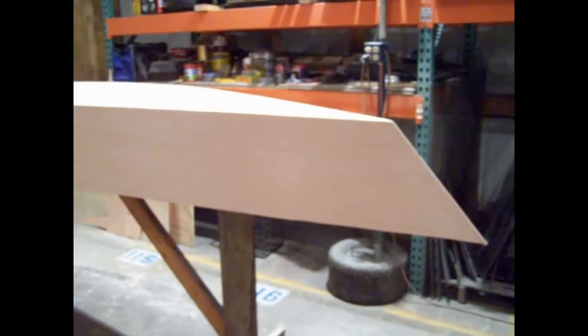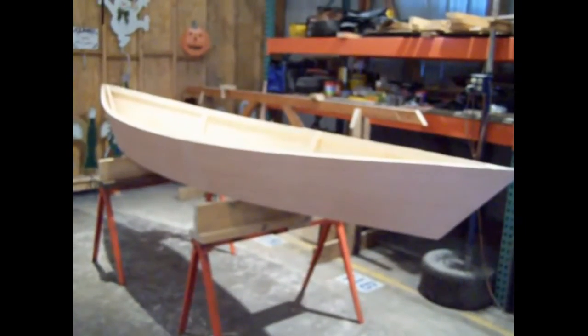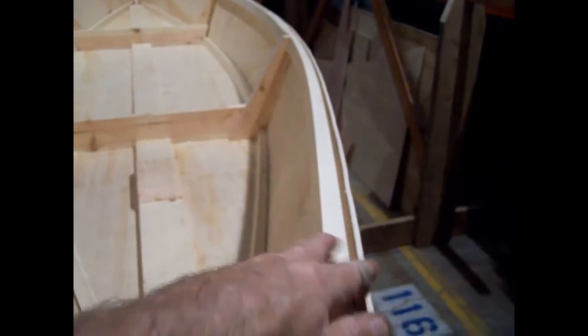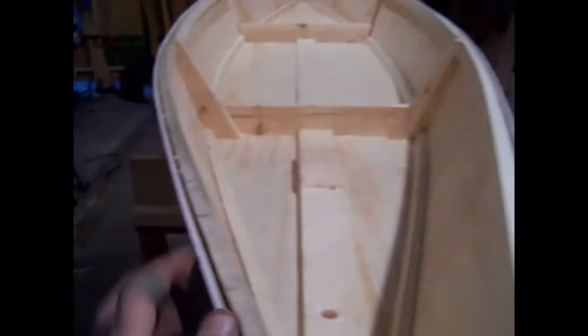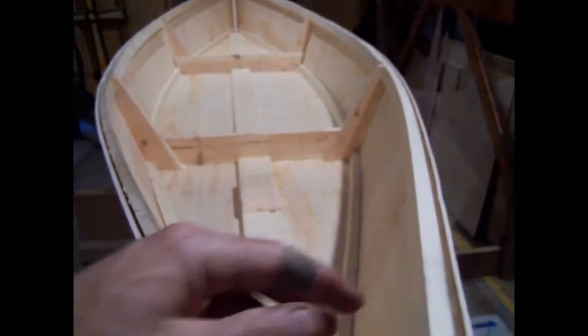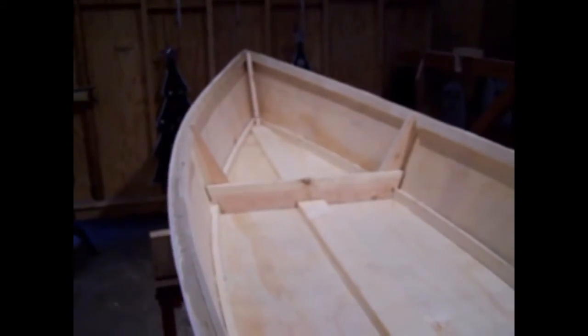I got all the side panels on, the bottoms on, fronts are glued to the stems. I trimmed all the excess off the bottom with the plane and got all the corners sanded nice. So now we're going to flip it over and see what it looks like. Just got it off the strong back, flipped it over, checking out how everything lined up. Some of the stuff didn't meet up the greatest — the shear clamps are touching on the back side where I glued, but in spots where there's a little gap I didn't want to tweak the wood. So I'm going to take epoxy resin, mix it up with some sawdust flour to make a thick paste to fill in all the gaps — down in the front by the keel and stuff. Then I'll take my plane, get all the excess off, get this cleaned up, and then I can flip it back over and fiberglass the bottom.